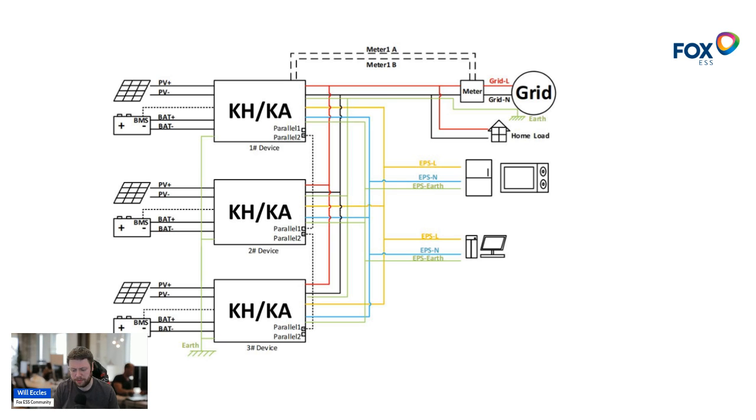It was mentioned that a future firmware update will allow setting the charge window on just the master, which will then propagate and mirror across all slaves. I haven't found it to be much of a problem because I set my charge windows the same every day and use Home Assistant to automate any additional home automations, so I rarely change charge times or work modes manually. If you're looking to scale beyond a single battery stack and inverter and want to go dual inverter, I highly recommend the K series or the H1 Generation 2 — both support parallel mode identically — merging all capacity and power throughput to serve your home's or business's needs. Any questions, please comment below.